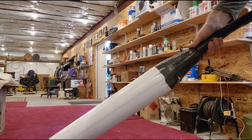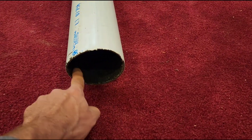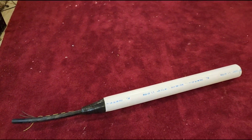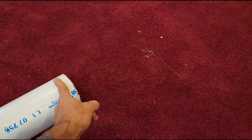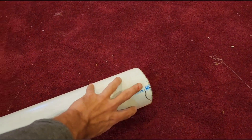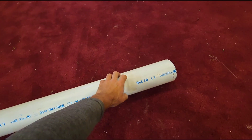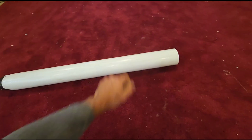It looks just like that — that's basically installed. Now that the pump is inside the pump sleeve, the only place for water to enter is down below. So when water, grit, and any sediment in your well is falling, the sediment is going to pass right by the intake. The water will make a turn and come back up through to the intake of the pump. All of that water, instead of going straight into the intake, is forced to run by the motor and keep it cool — that's why you get an extended pump lifetime with a pump sleeve.